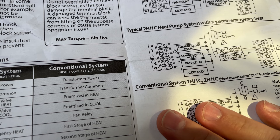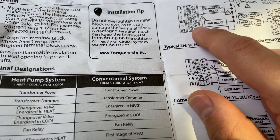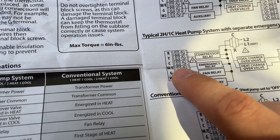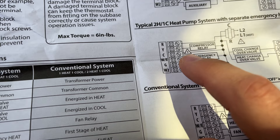For the propane heat, it's wired to the emergency heat terminal — the E terminal. The factory setting has the E terminal and the W2 (second stage of heat) terminals joined by a jumper, so you have to remove that jumper. Then we only use the propane furnace wire — the other wire from the propane furnace, the black one, is wired to the E terminal. The G terminal, which is for the fan, is not used in this case.